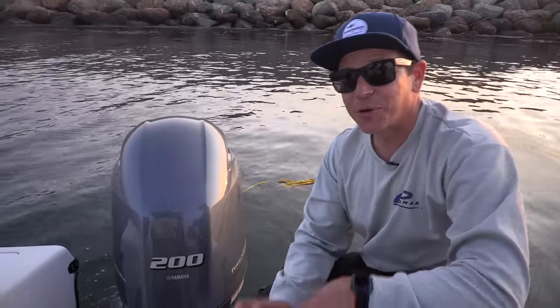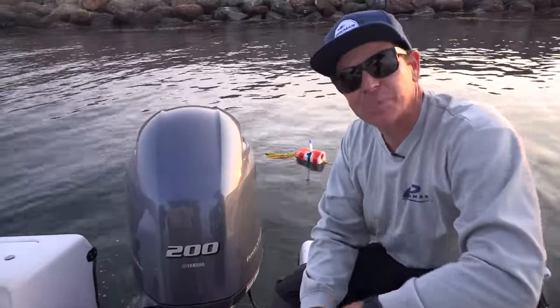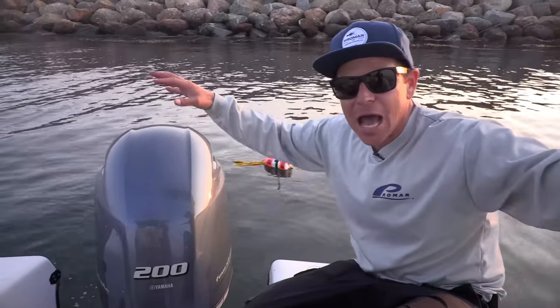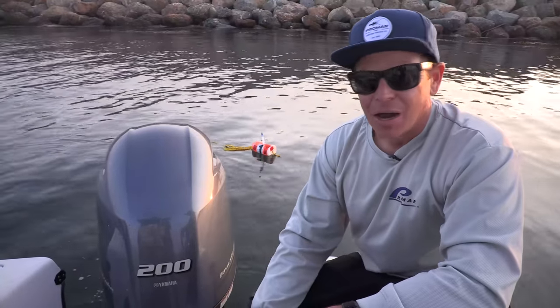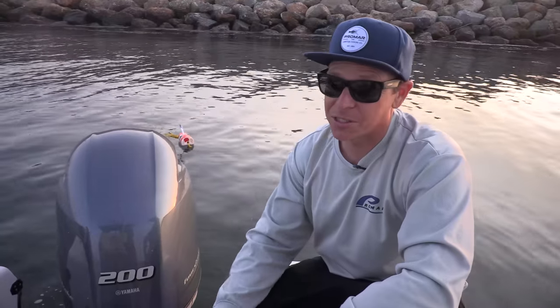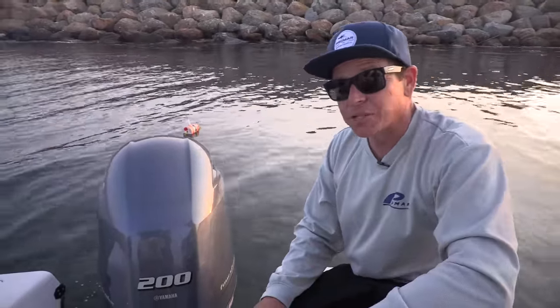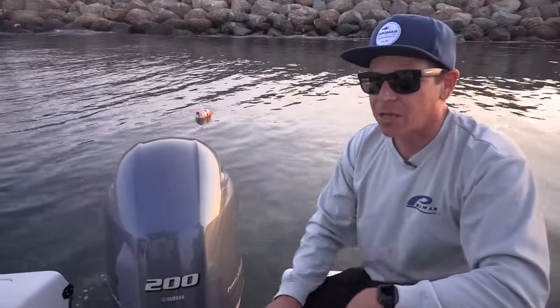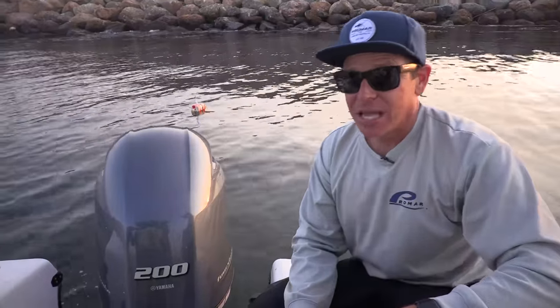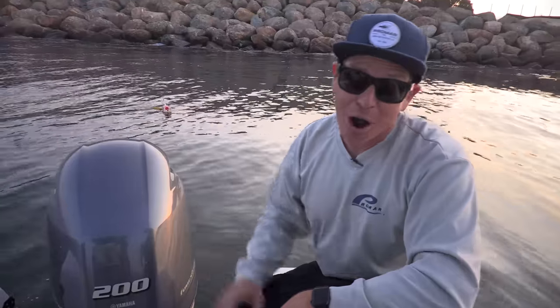It's very important when throwing your float and net that you don't have too much slack in the line. Behind us is our float with the light stick flashing — this is the ideal setup. You don't want 20 or 30 feet of excess rope, because boaters or kayakers can get it stuck in their props, causing boat damage and potentially hurting someone. Also account for tide swings — if there's a 5-foot tide, add an extra 5 feet of rope or your buoy will go underwater and you'll lose the net.